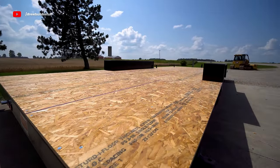Then I'd bring that house wrap back down over top and just use some house wrap tape to tape along these seams. Back at the bottom, I'd just use a knife to cut in a few of these tiny little weep holes, just so that if any water does get in behind this flashing tape, it can all drain out at the bottom. And again, that's only for my windows, not yours. And that's an installed window that should theoretically shed water properly.